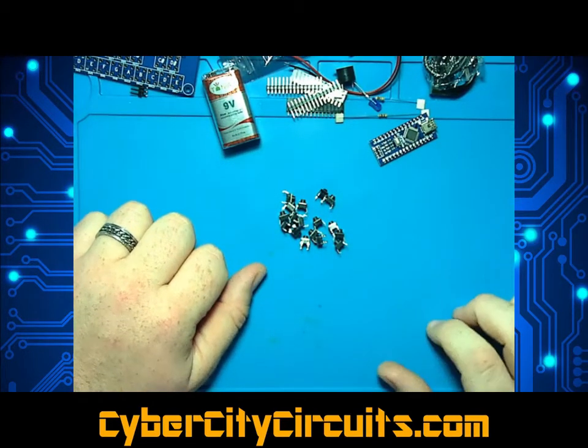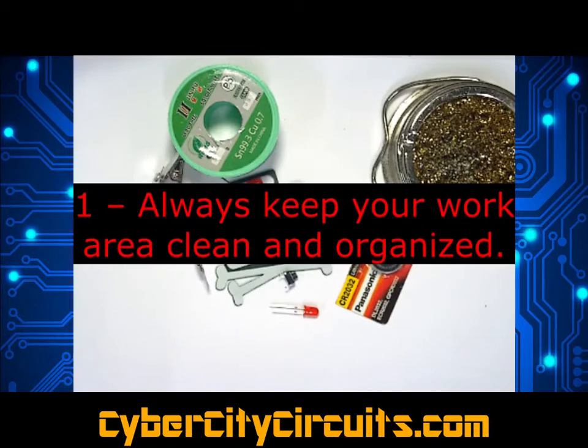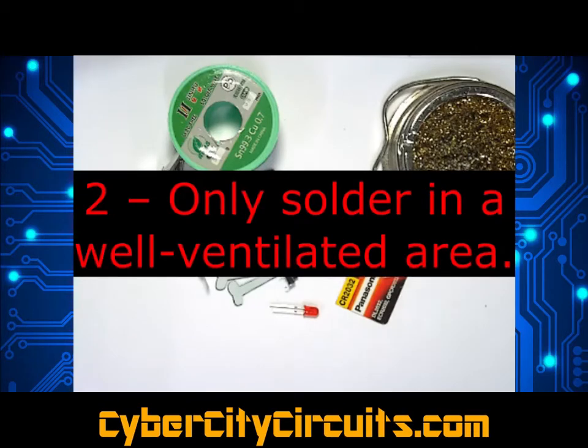So let's do that. Soldering safety rules. These are important, so pay attention. Always keep your work area clean and organized. Soldering can be dangerous. Keeping your work area clean will help prevent accidents from happening and keep you safe. Only solder in well-ventilated areas. Turn on a fan if you have one. Maybe open a window, right? You want the fumes to leave your area so they don't go up your nose.